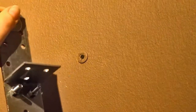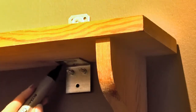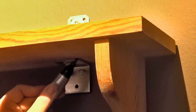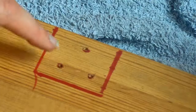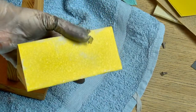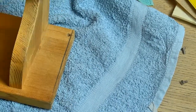First I'm going to see where the metal brackets are going to be on the wooden shelf, because the holes in the wall are actually off-center, which was from the previous clothing rack in the apartment when I moved here. I wanted to be sure the markings were correct so the shelf would be centered when attached to the wall. Before any finish, I want to pre-drill some holes so I know where the markings are, because I'm going to stain the wood and it might be too hard to see the markings for the screw holes.